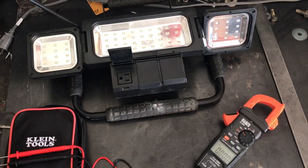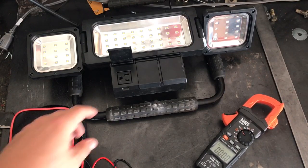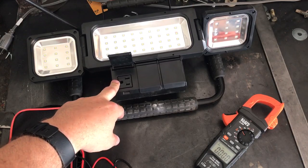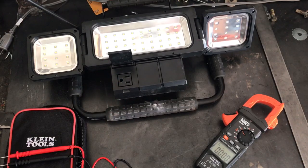Hertz is frequency. All your AC power in your house is 240 or 110 to 120. There's a lot of confusion about 240, 230, and 220 — it's all variability in your service from your power company, depending on how far you are from the transformer. If you're really close to the transformer you'll get true 240 off both poles combined in your power box. If you're further away you might get 230 or even 220.